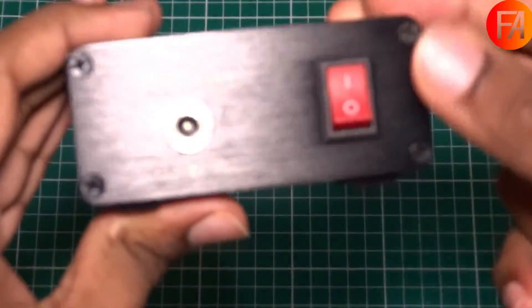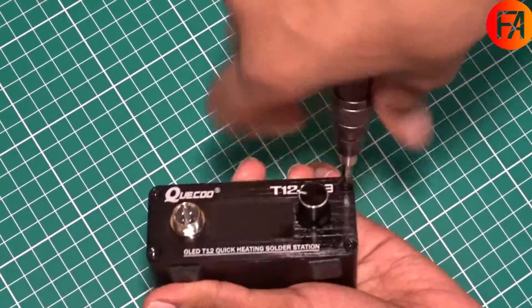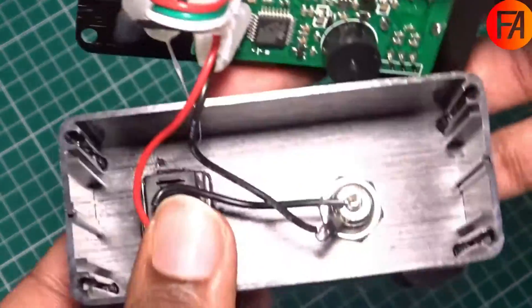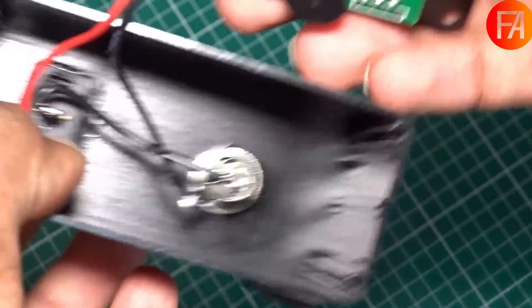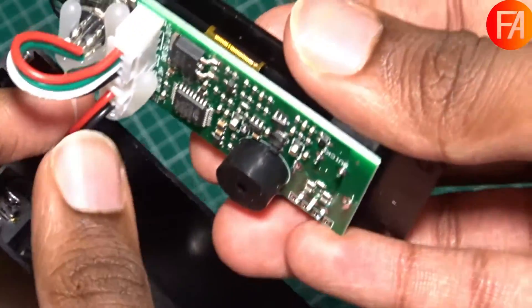It's assembled by four screws on the back metal plate and then another four screws on the front, so I'll go ahead by removing those. Now that we've removed the screws we can see the inner metal box. We've got the main circuit board over here, and then the back is just a switch which is connected to the power supply jack, which is then connected to the PCB.